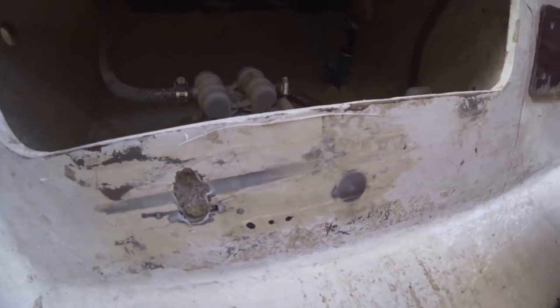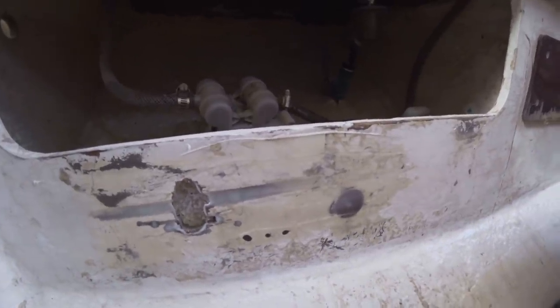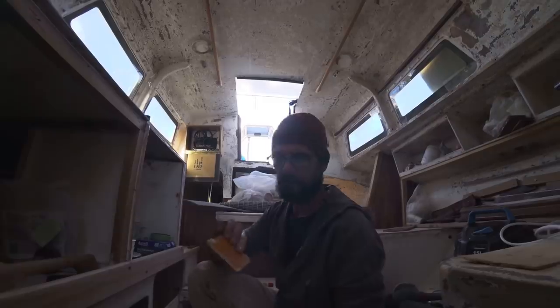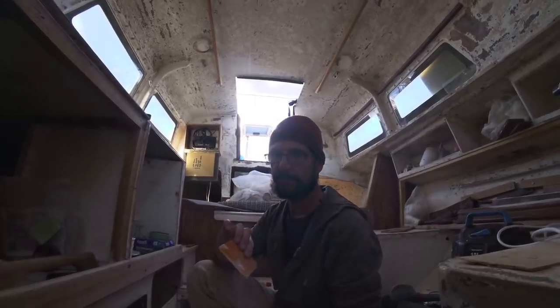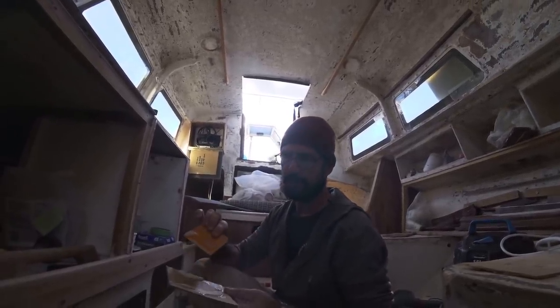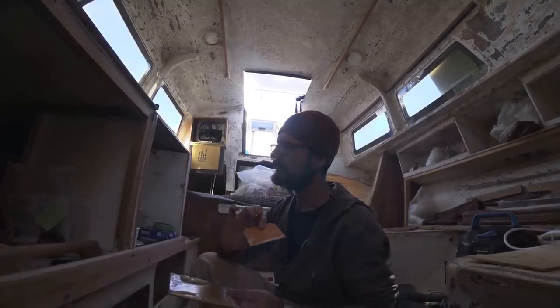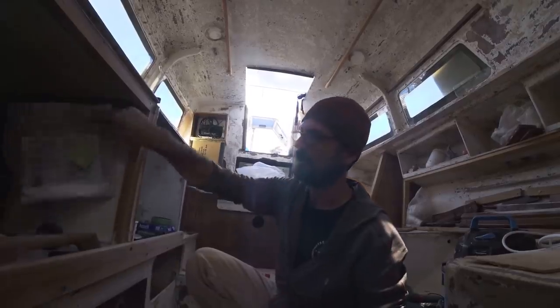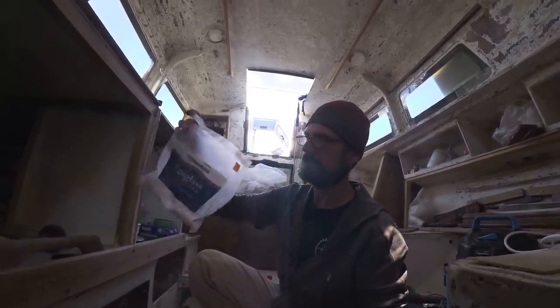Look at that. Pretty good. It's a bit concave. It'll have two cracks at it. You're going to go again. Yep. Because when there's a bit of depth to it, I'll just have it a little bit below the surface, and then we'll sand that, and then I'll use a final fairing surface with the microbeads, so it makes it easier to sand.